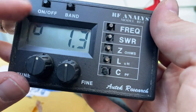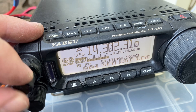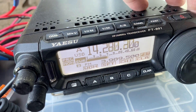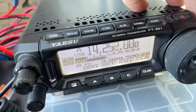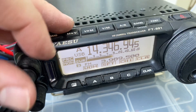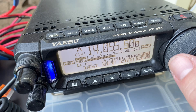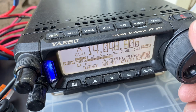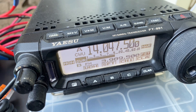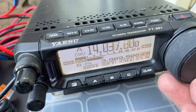Let's get the radio out and see how it sounds, at least on these bands. Looks like I was on 20 meters last time. And it looks like we've got about S7 noise on the band, which is frankly not as bad as I thought it might be. There's somebody coming in like an S9 to beat that S7 noise. I think it's 20 over S9 now — that's amazing. It's the CW Sweepstakes — CQSS for ARRL Sweepstakes. Wow, so busy band on CW today.